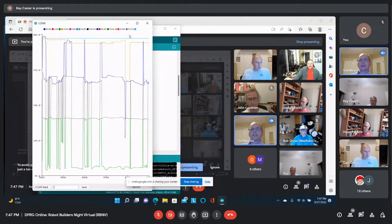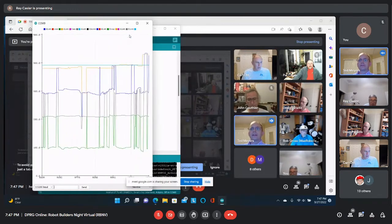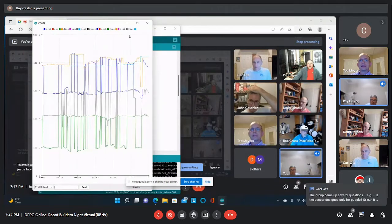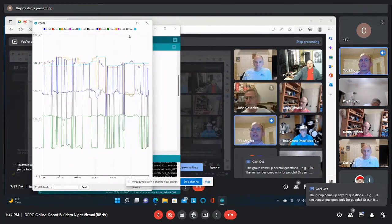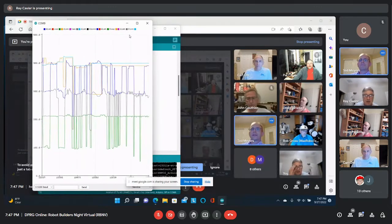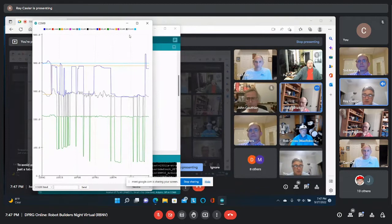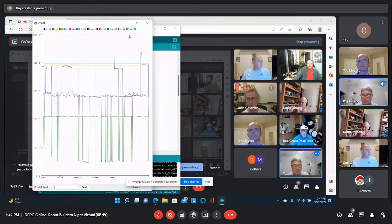Yeah, it probably has something to do with the wavelength of the radar. So, if it's a wavelength that absorbs water or something. Yeah, I was thinking that too. Or water reflects it or something. And something like a chain link fence, if the wavelength's too small, the waves will go right through the holes in it. Yeah, that's true. I know some of the shielding stuff had to be a certain size hole to keep the EMI trapped in the box. If it got too big, it could escape.